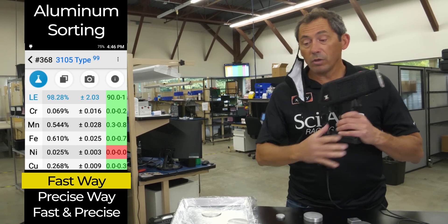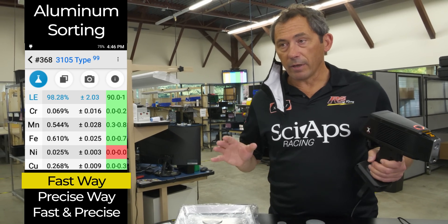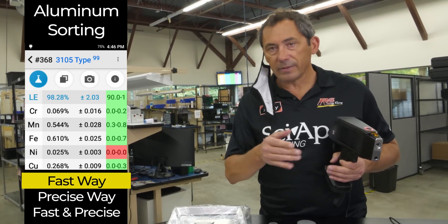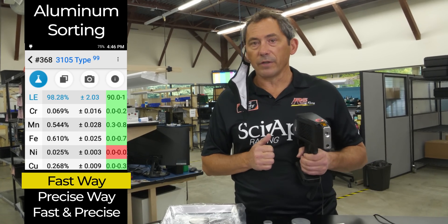So if you're doing common stuff, one-second tests are great with this new XRF — it's really quick and it'll do that. If you have a more sophisticated or wider variety of alloys, especially ones that may differ by some magnesium (Mg) or some silicon (Si), then you definitely want to go on to the two-beam test, and that's the subject of the next video.